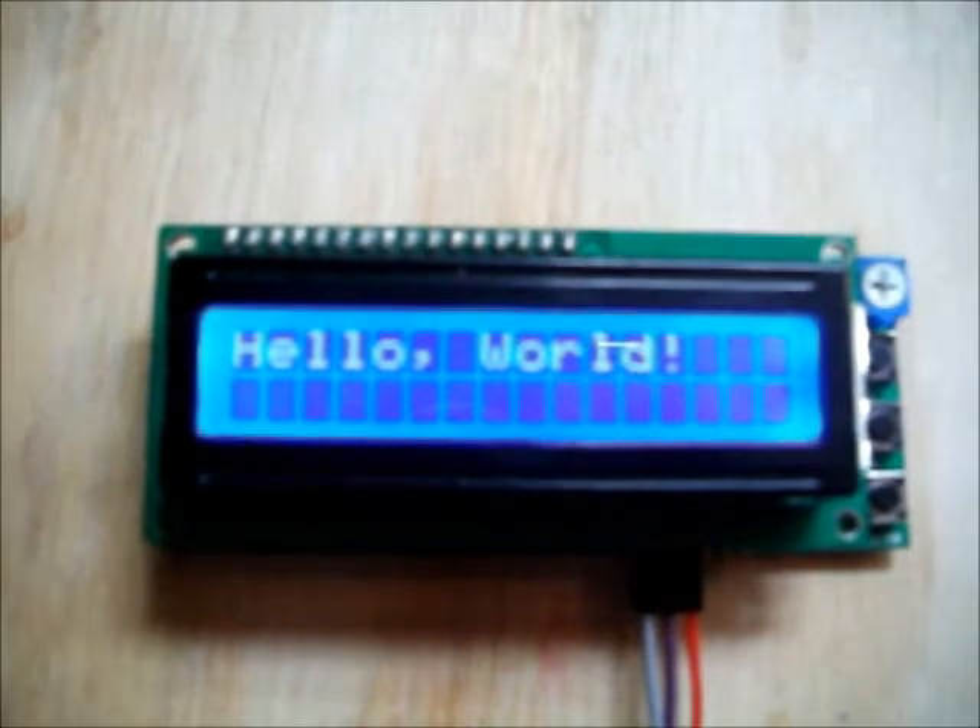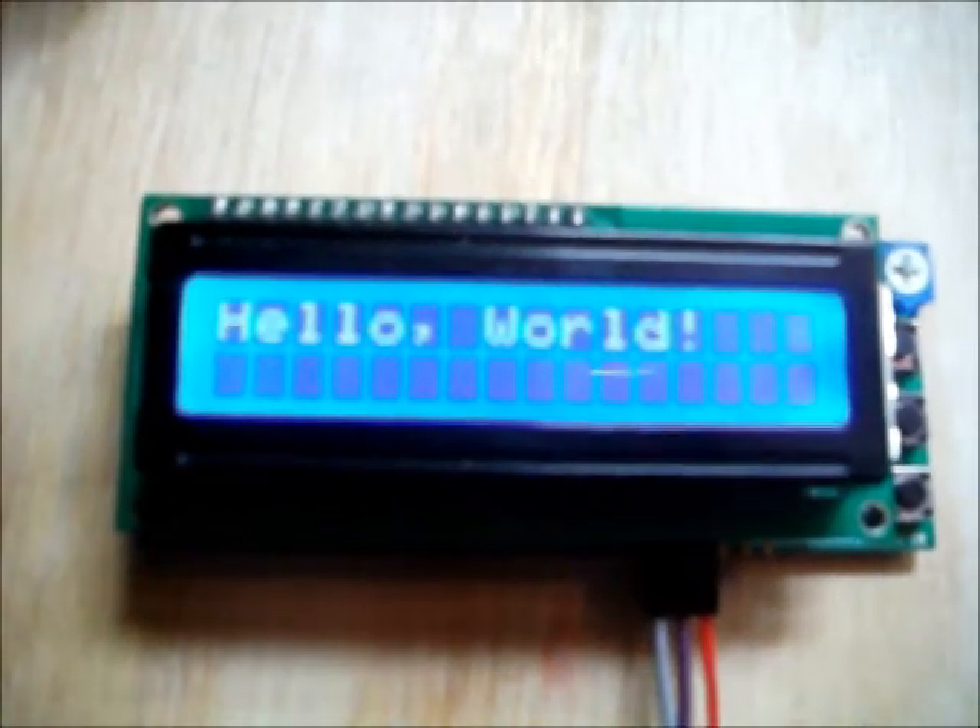I'm not sure how useful that actually is. Anyway, we're able to clear the screen very simply with a simple command. For the purposes of this demonstration I'm using what's called a Bus Pirate. This simulates a lot of different serial protocols such as UART, I2C, or SPI, and is made by a company called Dangerous Prototypes. On the computer I have a serial terminal, and with that I can write information that comes to this LCD, basically simulating a microcontroller. I'll write some more text back to the screen.